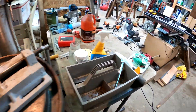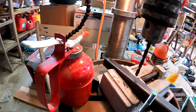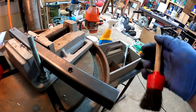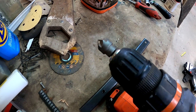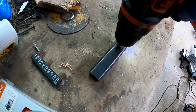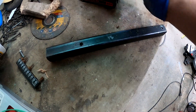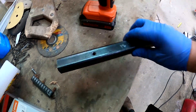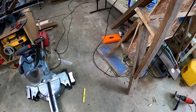The next step is to brush off the chips, pull this off, brush it, flip it over — and we've got a burr here. So we're going to take this over to the countersink bit on a drill and get that cleaned up. With the countersink queued up, we'll do some deburring on both sides, and that's nice and smooth.